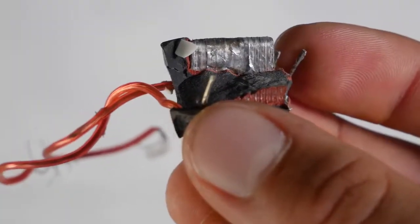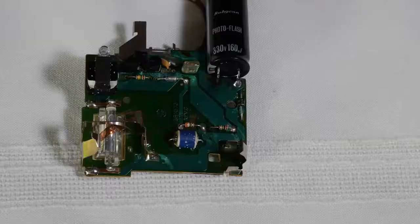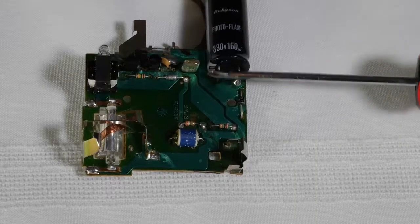At this point we have a perfect charge, but there's one more important thing in that high voltage generator: a capacitor. This capacitor holds a charge in between all of these tiny little metal plates, and that allows a current to build up as some of that extra energy from the transformer goes into it. As we see with this capacitor from a disposable camera, once it gets shorted out by a piece of skin — or a screwdriver — all of that charge is released. This allows for an even higher charge to be released when the stun gun first comes in contact with skin.